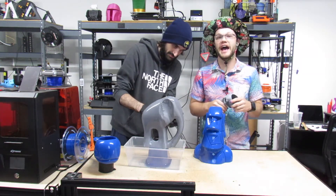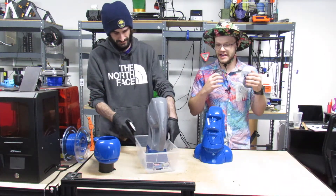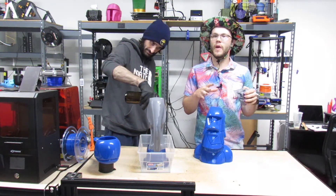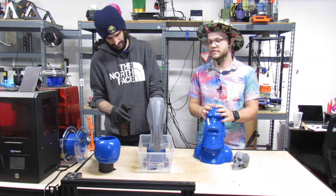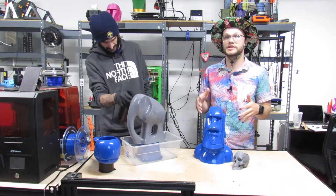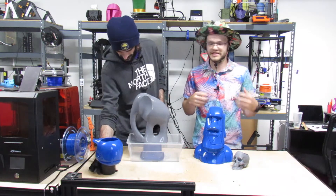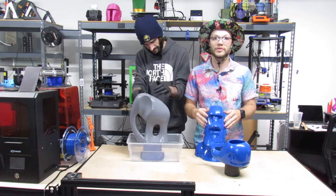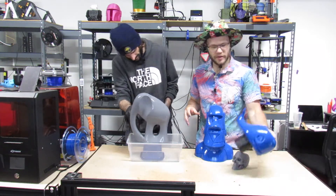The FL Sun Super Racer is known for printing extremely fast because it's a Delta printer — it just busts out prints super easily. But with this filament it was printing too fast, so it kept clogging up. We kept trying to mess with the temperature; it was a hassle at first. Since this is a new type of filament, we lowered the print speed to about 40% and that's when we started getting the best quality. Our recommendation: slow it down so your printer won't clog and can extrude the filament properly.